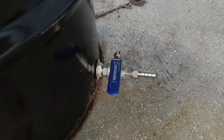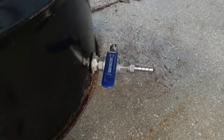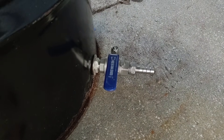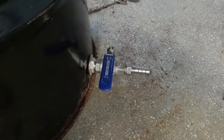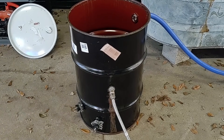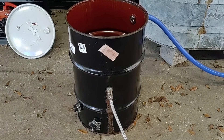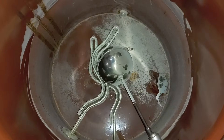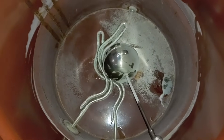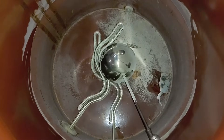I also would have found a different drain. No matter how I adjust it, it always seems to leak a little bit. I would have gone with another weldless bulkhead fitting and a different type of drain — maybe a different brand. But it has a steady drip, and I stopped caring because I have this set up outdoors. And finally, the barrel itself — if I had the extra money I would have definitely gone stainless steel. But on a budget, there's nothing wrong with one of these barrels; just expect it to break down faster over time. You're going to want to drain this after every run — look at all that sediment in there. That's what breaks down your elements.